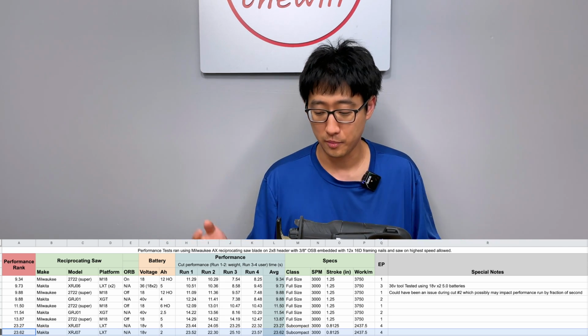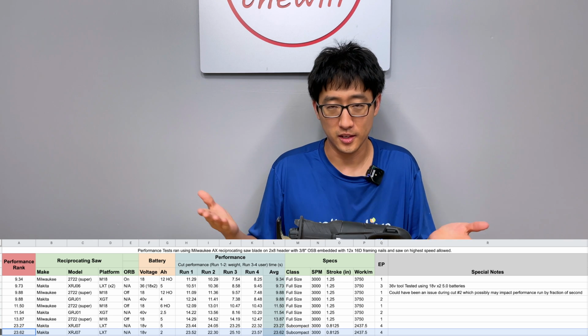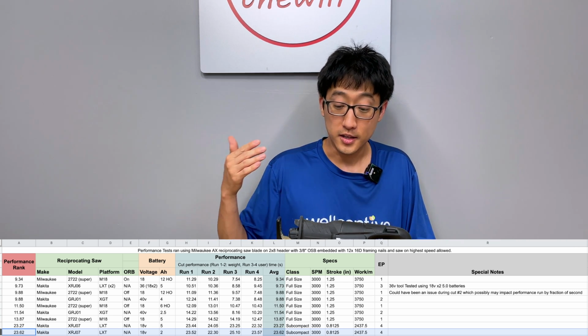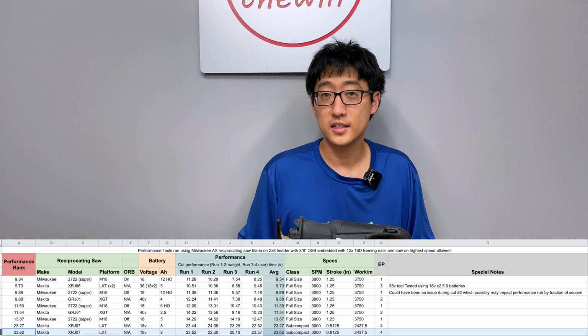It doesn't have all the bells and whistles like the big saws primarily do, but in a subcompact saw, you probably don't need that, right? You could use this saw for cutting EMT or Unistrut or Super Strut, stuff like that. It's designed for smaller jobs, right? One place we use this a lot is for cutting PVC pipes or anything like that overhead. So anyways, the point is that it's a good saw.